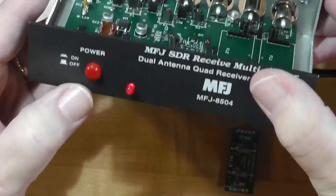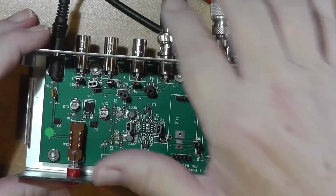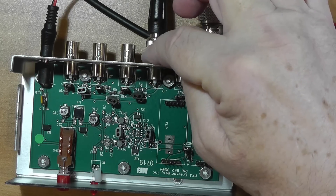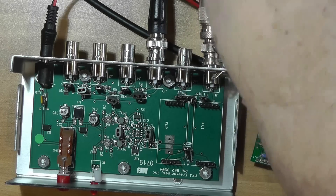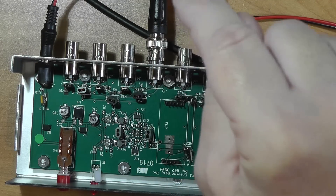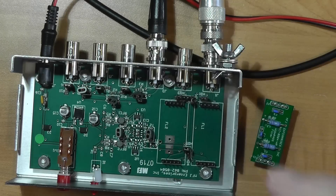This is powered by 12 volts. There's a little light that comes on when you turn it on. If you turn it off, everything goes away — this doesn't pass anything. In this situation I have just the one SDR receiver hooked up right now. What's really nifty: let's suppose you have an SDR receiver — you could put that on this. And then you also have a regular receiver that has a separate receiver input; you might want to connect that here so that the same antenna feeds both the SDR receiver and your regular receiver. Or if you have a little SDR you use for some particular application, like ADS-B, you can put that on one of these ports.